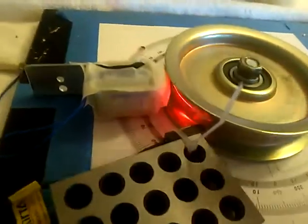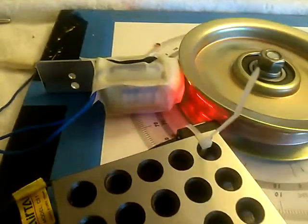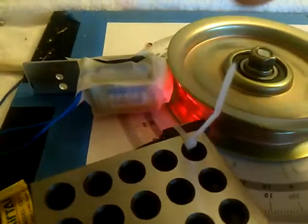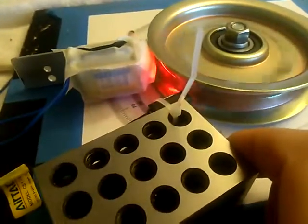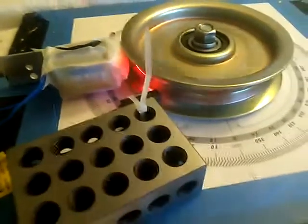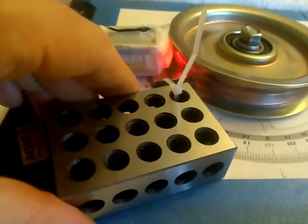What we have here is a pulse motor. This is a DC solenoid — we took the plunger out and put a nut on the end of it, keeping the plunger in there with some tape. This is a magnetic reed switch right here; you can get that on Amazon for about six bucks. We have a relay here for the switching device and a 12-volt battery. Depending on the position of the reed switch, that determines the speed of the rotor.